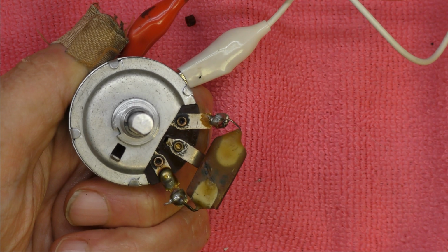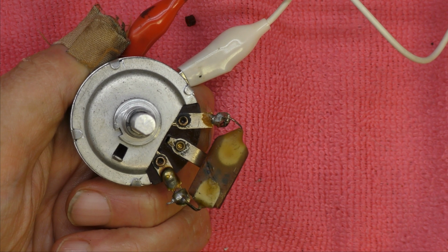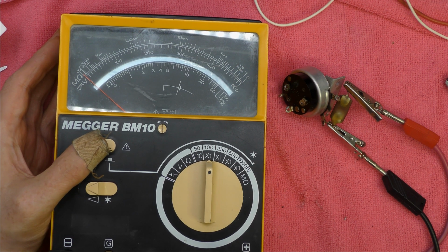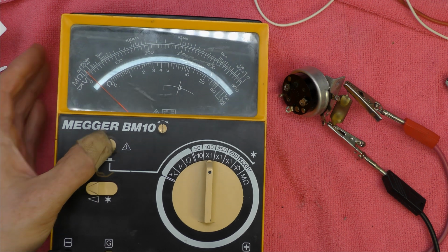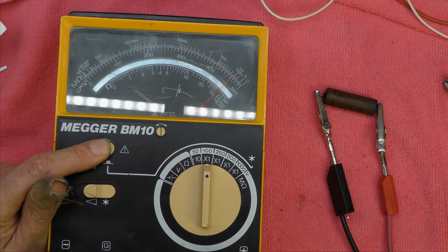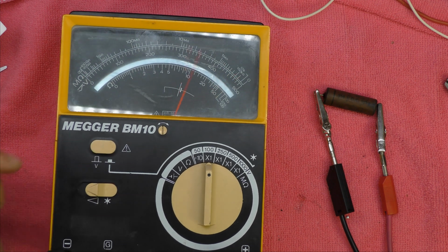Yep, that seems a little bit more satisfactory. It's on when it's on and off when it's off. So just to prove that there isn't a problem with these capacitors, let's give it 100 volts. Yeah, no problem at all. So these ones are obviously okay. Let's give one of the paper ones a zap. Yeah, about 100k. That's not good. With the high value resistances in this battery radio, that really would cause havoc.